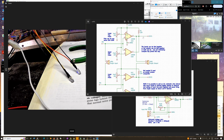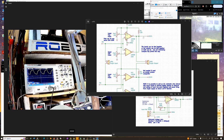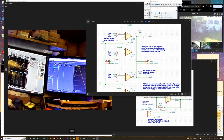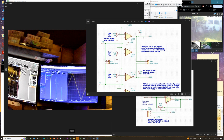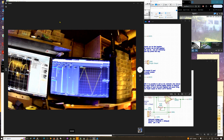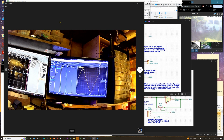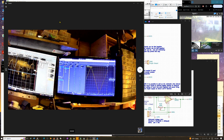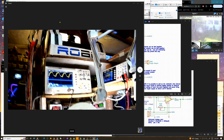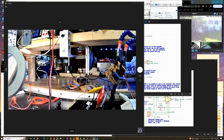You can see I've got it connected to a couple of LEDs, and that's the current shape of the input signal I'm applying to it. It's a triangle wave, but because the Analog Discovery only has about a 5 volt signal range DC-wise, I was wanting to get more amplitude out of it. You can do double that AC, but this is a DC only circuit, and I'm running it at like 9 volts right now. I could go to 12, which is what it was designed for.